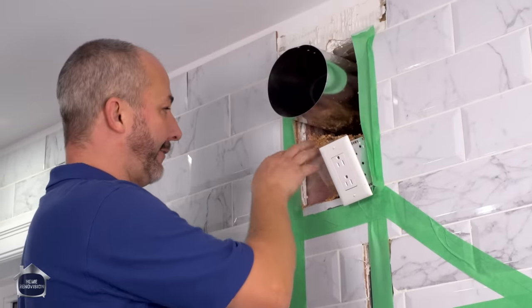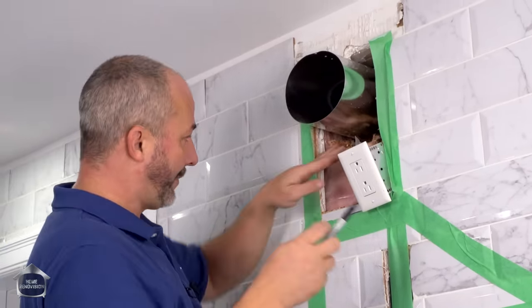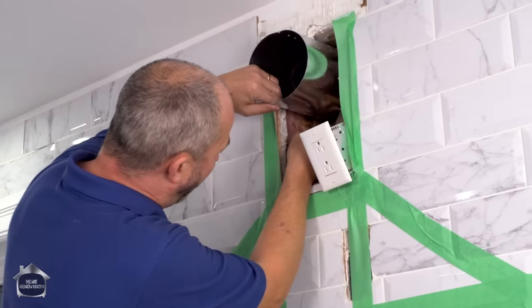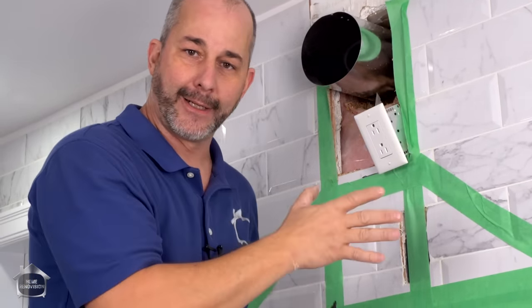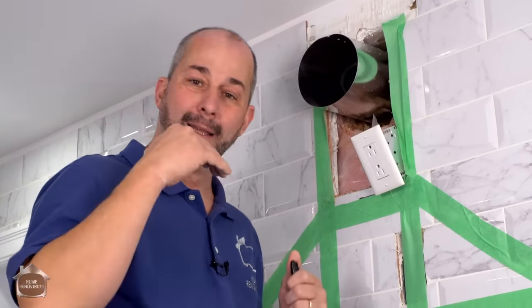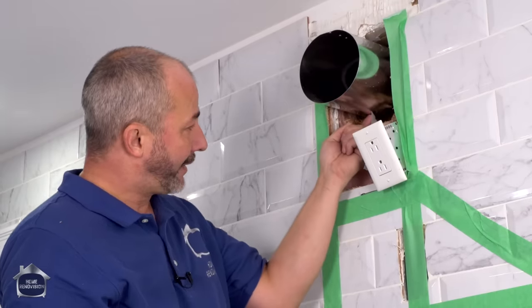Okay, so the way I'm going to finish this off later is I'm going to be filling this cavity with expansion foam. It's the only way that I can get anything close to a good insulation level, which means the first 2 or 3 inches of that cavity is going to be foam. I can actually cut my tin way back inside there. Then I can put the exhaust on, screw it from the outside, put on the protective seal. Even though there's a light rain and it's only a couple of degrees outside, the exterior caulking that we've purchased is going to be no problem to perform and cure in that kind of weather. So I'm more than happy to take care of that today. Get that all finished up and sealed up. And then once we get this installed here, I can foam this area. Then we can worry about mounting the hood.